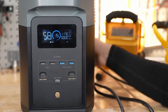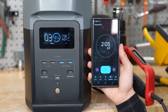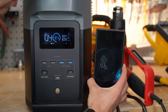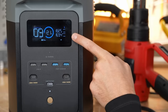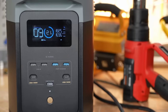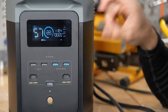Let's run a smaller load — just the heat gun at max output without the lights. It seems to like this load, it doesn't seem to mind it at all. Now let's add the 250-watt light. Now we're at 1700 watts. Also this is the intake and I have a heat gun right next to it, which is not the best. The input pretty much matches the output so we're not really charging. On the older models they would overheat with large loads and throttle the charging current, but it is holding up.